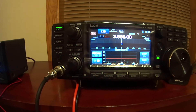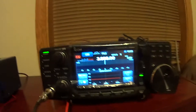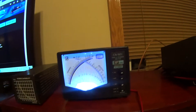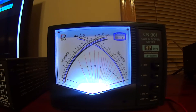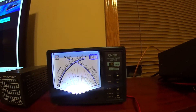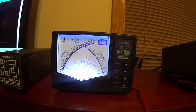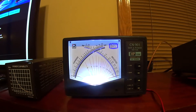This seems to be working just fine. I did do the SWR check — it's good. It's on sideband. I think this is a 100-watt unit so it should be right around 50 watts. I'm on the 200-watt scale. Doing a quick test — that's about 25 watts right there. We have a flat SWR. It's pushed in so that's PEP — let's see what average says.